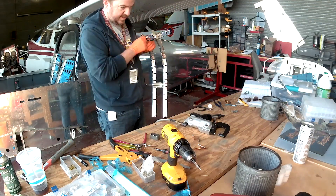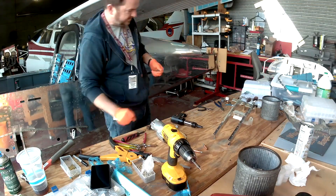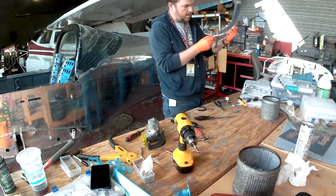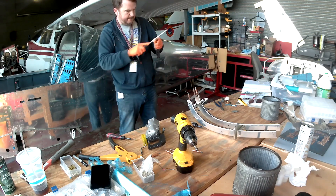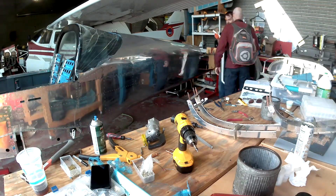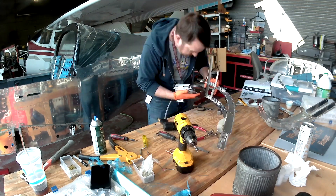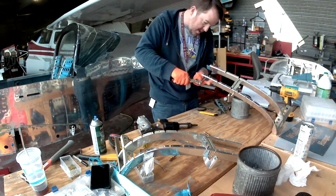Unfortunately it means having to use a rivet gun. When you're dealing with small delicate pieces that fit together like this, you'd really love to use a squeezer — very convenient — but unfortunately you can't. A lot of these are size 4 rivets, which are bigger and require more impact energy to set. Heavy power on small pieces equals denting, so you've got to be careful. And with small pieces, getting a bucking bar back there against a certain piece is a challenge.